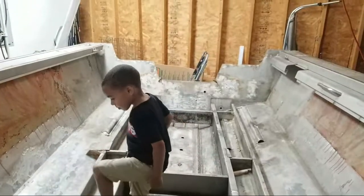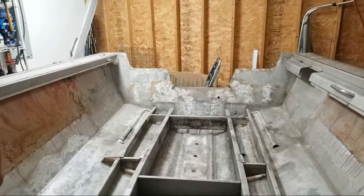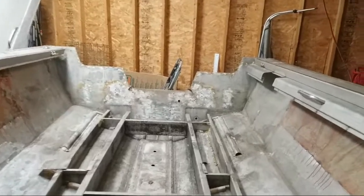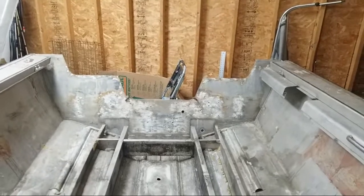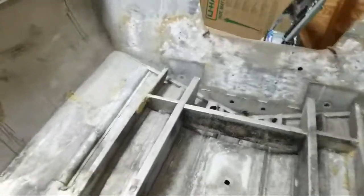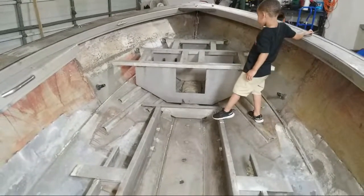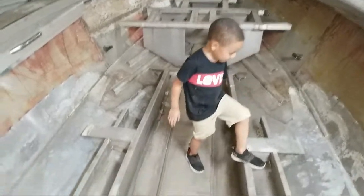Like I said, if you look at the specs for a Mercury Pro XS, the 2021 models, the 200 and the 300 are identical as far as specs go. Same block, same everything. So it's going to get a 200 motor on it, and I'm going to look at bumping it to 300, or I'm going to put the VMAX on here. And it will in turn be set up for 300-plus horsepower, but it will have a new motor on it. But this is what a Tracker looks like when they're gutted, completely gutted.